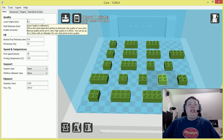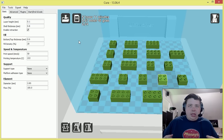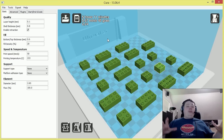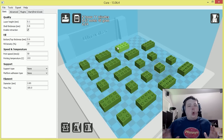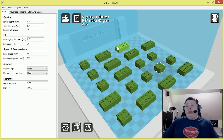I'm printing with the default settings, although I did set the layer height to 0.1 millimeter, because when you're dealing with Legos it's really tight tolerances. We're also printing in PLA, which is a much more rigid plastic than ABS, so in order for these things to fit together you want those tolerances to be extra tight. I went ahead and saved this to the SD card that we'll put into the Ultimaker controller so the unit can print autonomously. I don't like leaving it connected to the computer — you can do that and have Cura print for you, but I don't want to risk the computer locking up or a crash wasting all that plastic. So let's get these going.